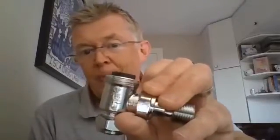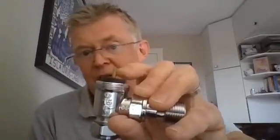And now on the RT414, again, it's the chrome valve, but we're now using the valve with the adjustable flow rate. So if I take the head off, you can see the typical insert that I've demonstrated many times using the balancing key, and I think you've probably all got balancing keys by now as you're members of this group. This valve has a number of important advantages for the end user. One is obviously balancing. You can set a flow rate and balance your radiators much more accurately than you can using a lock shield, and it's locked in place like we've discussed before.